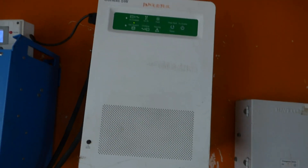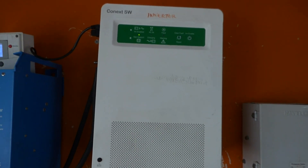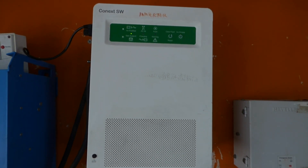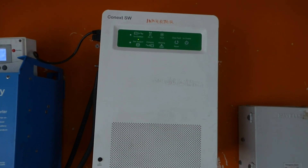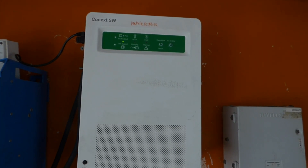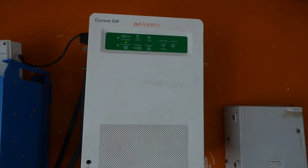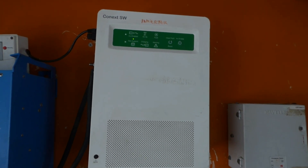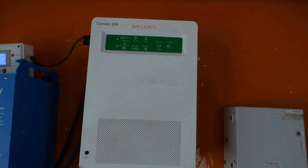One thing I have to tell you - when my refrigerators or freezers kick in, the lights do not blink like they did with the Growatt. The lights would blink noticeably when those items came on. This unit does not do that. I guess one advantage is not only the fact that it has a transformer, but also Growatt is relatively new compared to something like a Voltronic, the people who made the Axpert.